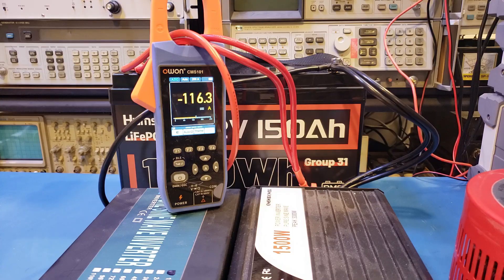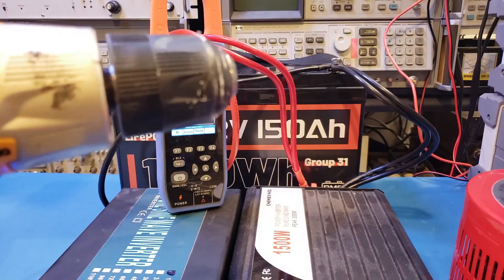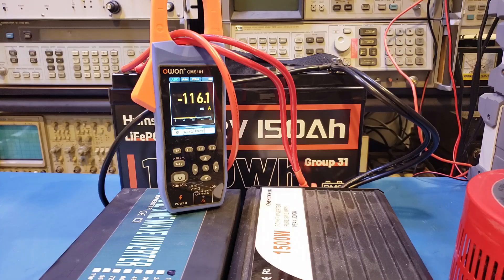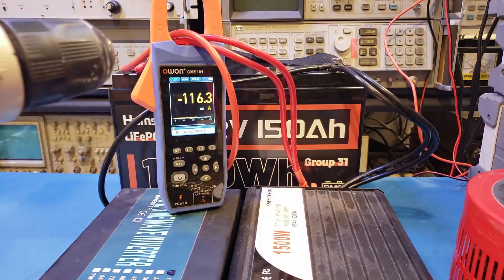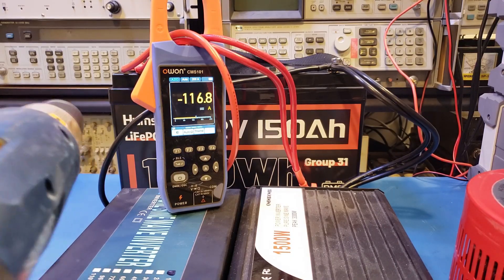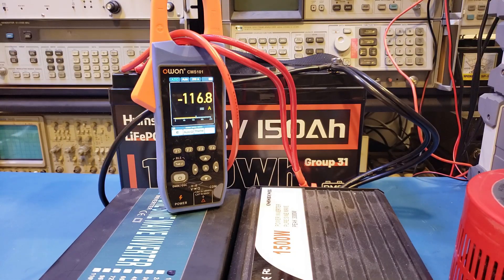I just powered up the inverters again, and this time we're drawing roughly 115A. What I'm going to do next is, while running the heater at around 116A, I'm going to try to start this power drill — it would draw roughly 160 to 170A during startup, putting us well above the 110A rating. We'll have to see whether or not it cuts off. The drill will be very loud, so fair warning. And you can see that we handled the drill with no problem.